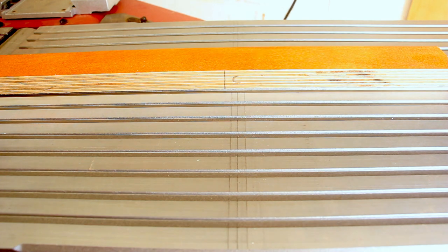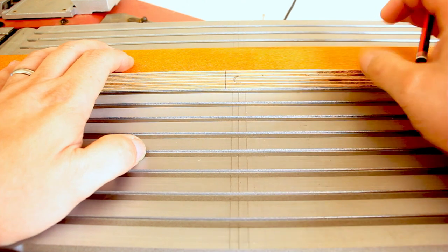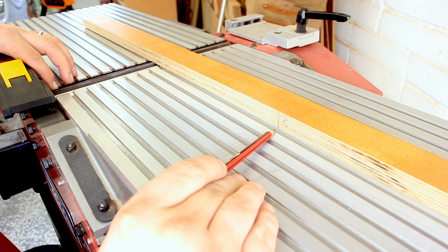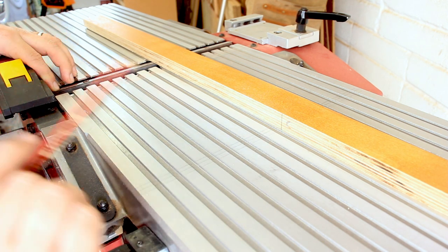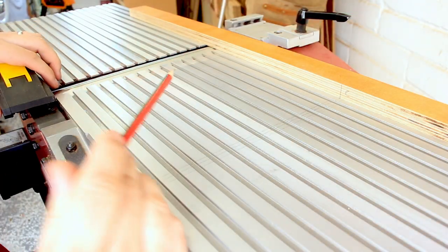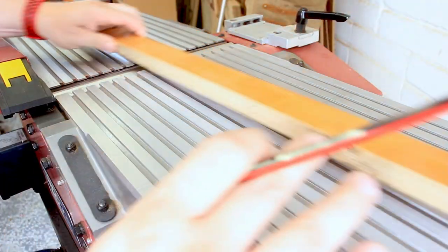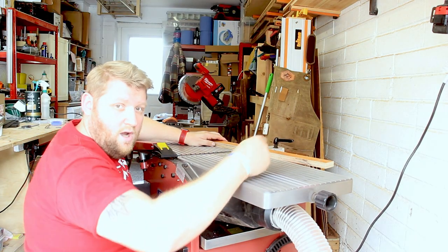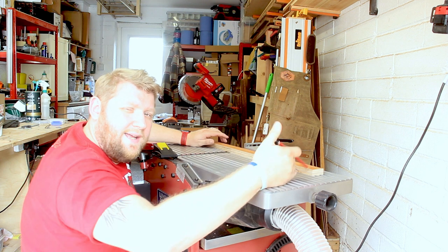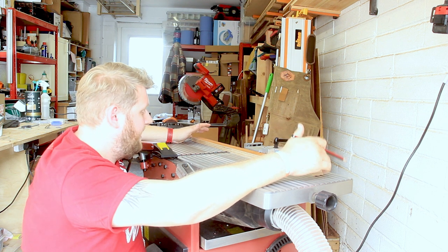This central line, five millimeters that way and five millimeters this way — this is going to make it easy for us to tell how far the blades are making our wood travel. So you're going to get yourself a nice bit of wood that you know is flat and square. I'm using this lovely bit of plywood — I've put a central line on it marked 'C' to go on the central spot. From here, when I rotate my blade, you will see it travel along and land directly on the next five millimeter line, which is good. I can then move it down to the other side, rotate it again, and you'll see it reach the five millimeter line on that side. Do exactly the same thing all the way along on both sides, making sure it only travels within those lines. The more even you can get it across the better — that is the easiest way to fine-tune and set your blades on a planer.